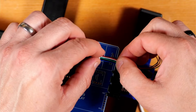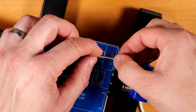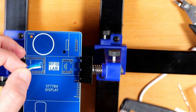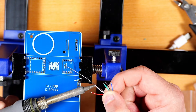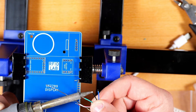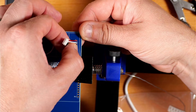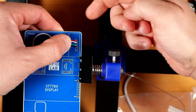Next, the Instructable tells us to trim the five wires from the JST pigtail to about 17 millimeters. I eyeball it and make a good guess, then use cutters to cut those off. Then I use my quick strippers — I'll put a link in the description — and tin each little end of all the wires. Then I stick them in and get them soldered into place; the last one I ended up attacking from the top, but once those are in you're good to go.